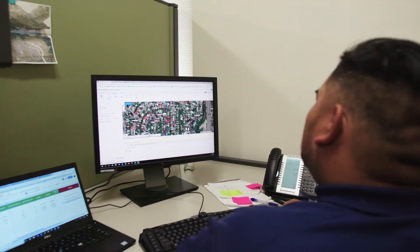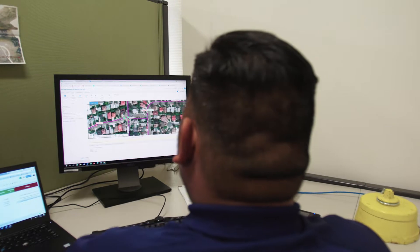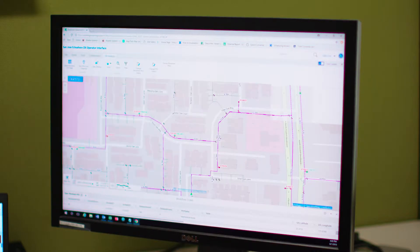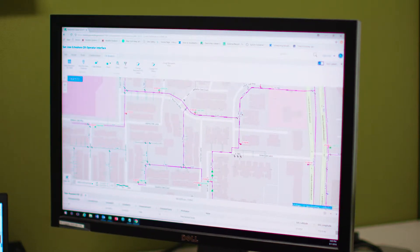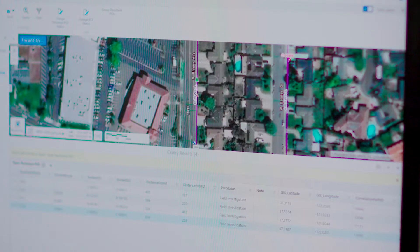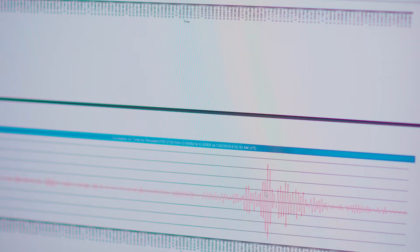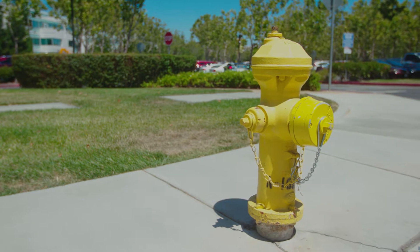The user interface POI layer provides a great deal of insightful data for a utility operator. The acoustic metrics and chart history enable utility personnel to view and manipulate a correlation graph, which is ideal for both novice and experienced leak detection technicians. It also provides the user with a numerical score at the end of the day, which allows them to compare and prioritize leaks based on the strength of sound provided by the correlation, increasing confidence in properly identifying the location of a leak.